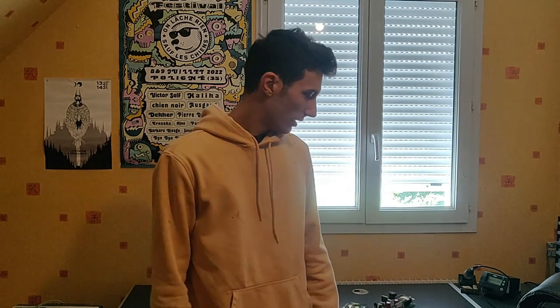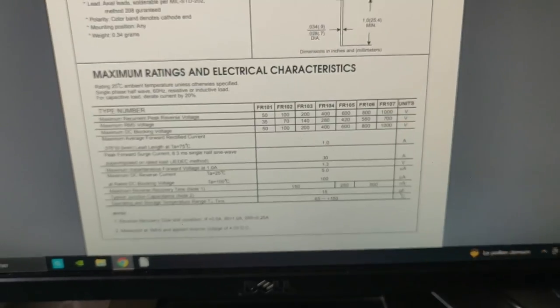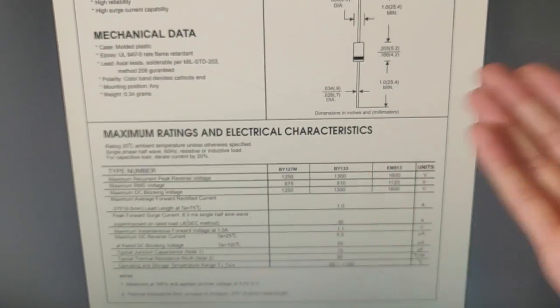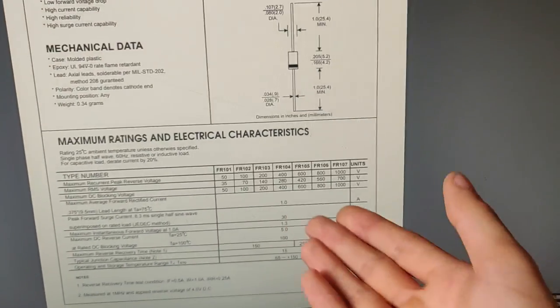Something I got completely wrong about the diode: you need to be careful to use the correct voltage rating. I thought 400 volts was enough because it's a mains power supply, so I was like 'it's rectified mains.' But no — the placement of the diode means it will see high peak voltages. I need to account for that. Fortunately I found a replacement: the original is 1000 volts; the one I found is 910 volts RMS and max 1030 volts, so quite good. Current is one amp for both — that's alright.